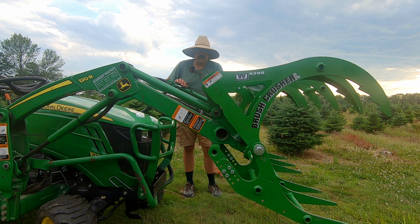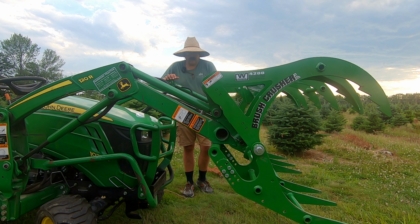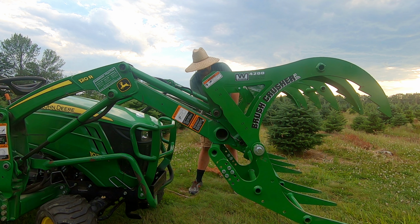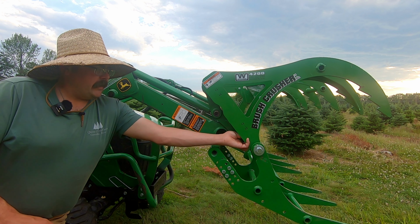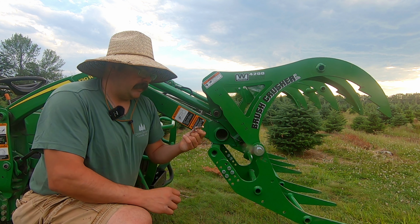The last major heads up that I want to share with you, I saw this on a YouTube video, I don't remember which one it was, but a guy was upset. He was frustrated because he broke his tractor. And it's a forewarning just between two YouTubers that you need to be very careful when this bottom has pressure put on it and forces that pressure up onto the lift arms of the tractor. And what ends up happening is it causes the pins that hold the bucket on to break.